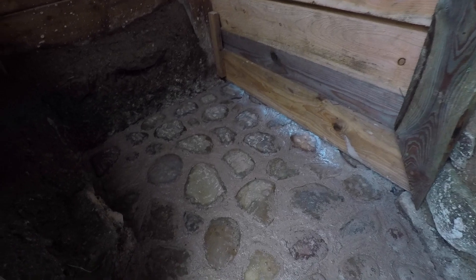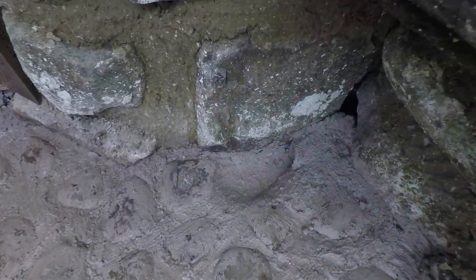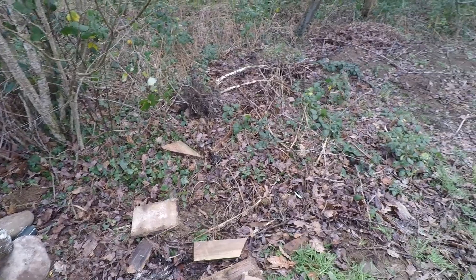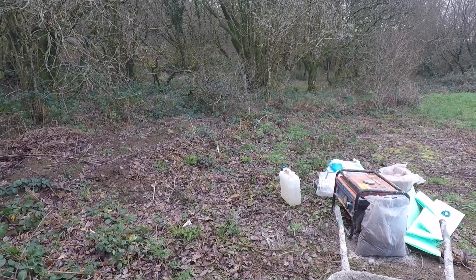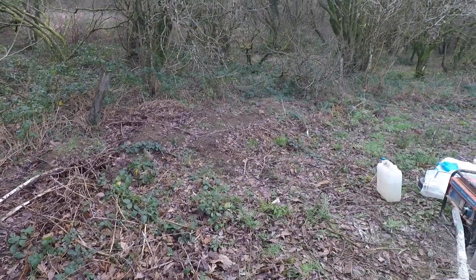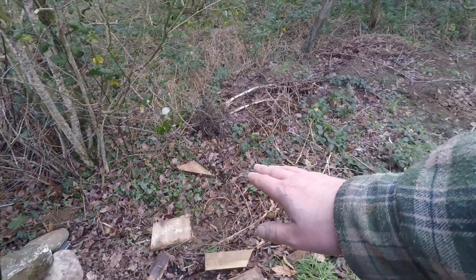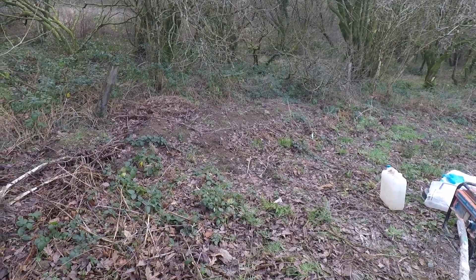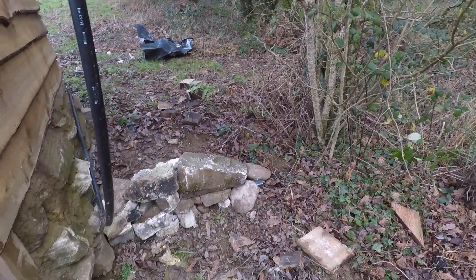Check it out - pebble floor. It all slopes down in this direction and it's slightly higher here, then slopes down to the drain there which goes out the wall. This plumbing needs to connect still and there's like a dip here that will be our drain. It's a wet area anyway with weeds and stuff, and the stream is at the back there - so it's not draining straight into the stream because there's a raised bit. It'll only be biodegradable soaps, so it's not going to cause a problem. It's just going to run along here and the nutrients from it will get used by these plants - kind of like a basic reed bed system really, but without reeds, just weeds and stuff. They'll suck up the nutrients before it gets into the stream.